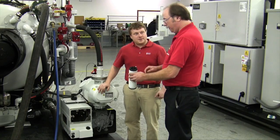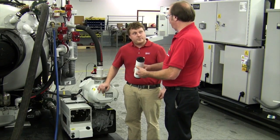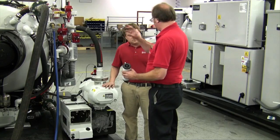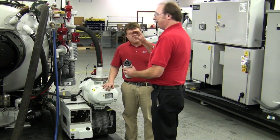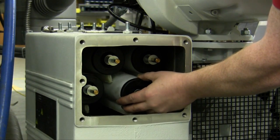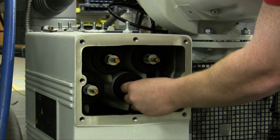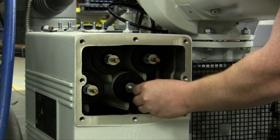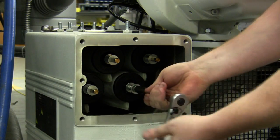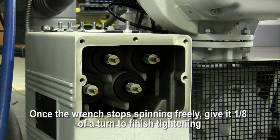At this point, we're just going to reinstall this exhaust filter as if it's a brand new filter. Once installed, all four filters should be at the same level — in other words, pushed in the same amount. If you see one sticking out further than the others, that tells you the filter is not seated properly. Start with the large flat washer, then the spring, then the other large flat washer, then your brass nut. There's no actual torque setting on this because we're pushing against a spring. When tightening, your wrench will spin and then stop spinning freely — at that point, just give it about an eighth of a turn to snug it up.